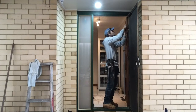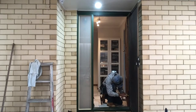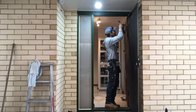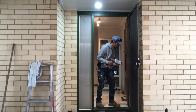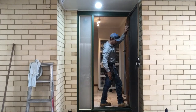First thing you do is take off the old door. Start by cutting around the old hinges with a Stanley knife, just to break the bond of the paint so that doesn't rip out any bits of timber. Then you want to beat the paint out of the screws — flathead screwdriver if that's what's there, otherwise use a Phillips head and give a little tap so you can get the driver bit in on your drill to take those screws out. Then just take that off ever so gently.